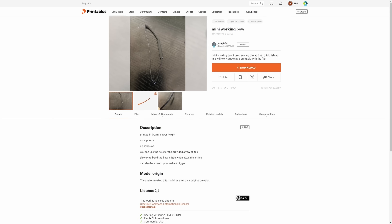In the best cases they're using PETG, which is not a material I would use here — PETG would probably just yield; it might not break or shatter but it will deform permanently and then you can't use it again. I'm not even trying PLA, that's a terrible idea. What I mean is: starting with something like PETG, seeing where the faults are on the bow, is how I know what I need to redesign and improve.